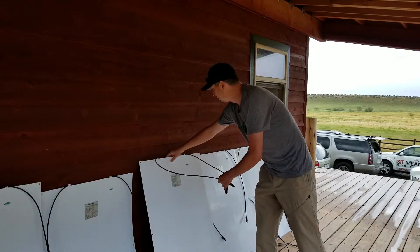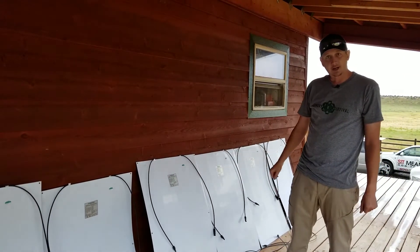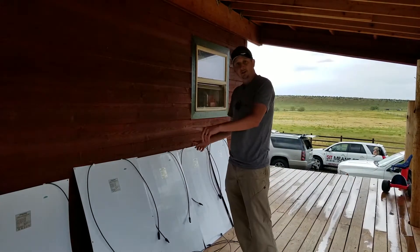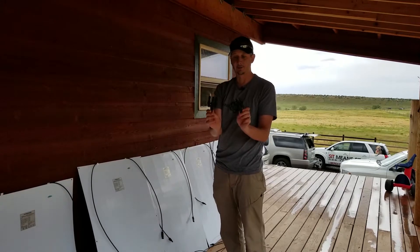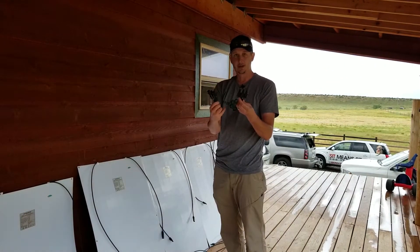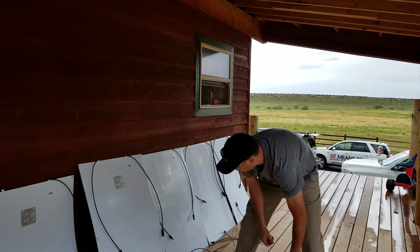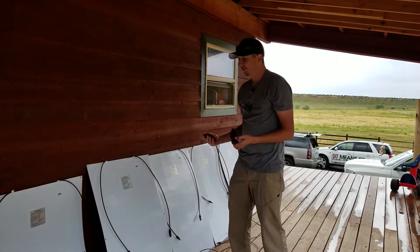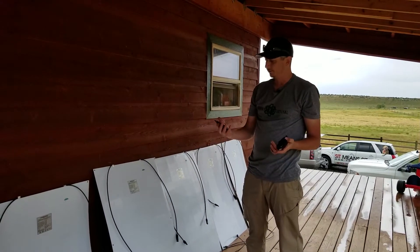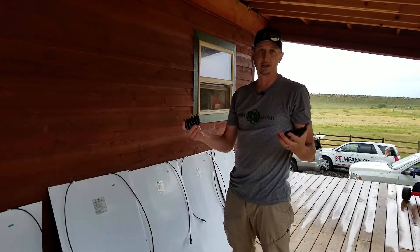I have all the panels backwards so I can show you how to hook them up. It depends on how many panels you get — right now I have all six set out. If you just buy three, you'll get branch adapters that look like this: three males, three females, one output on each side. For six panels you get the six-way connectors. If you get five panels you'll get five-way connectors, four panels four-way connectors — basically however many panels you buy, you get the connector that works with it.